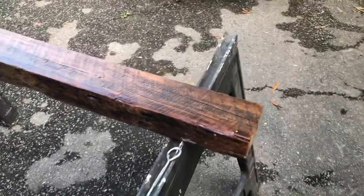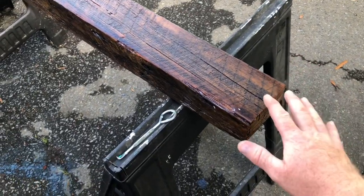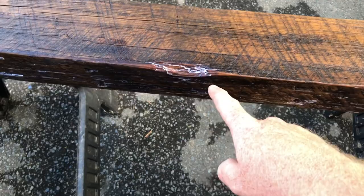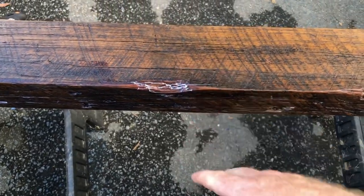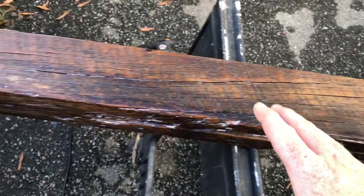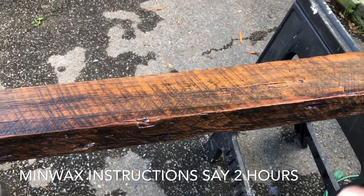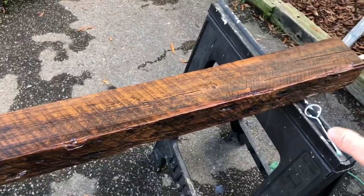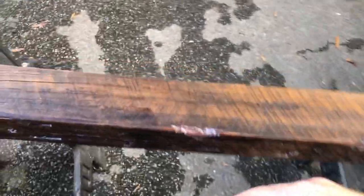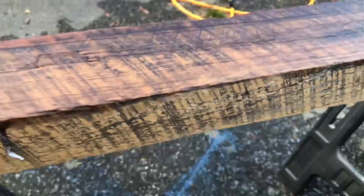You can already see the difference it's making. We've done two out of the four sides — I don't want to turn it on the wet side on the sawhorses while it's still wet. Here is a side with one coat; as you can see it looks so much different. These little air bubbles from the brush will eventually dry out and you won't see them. If you do, you can sand it again and go over it one more time. The Minwax directions recommend after it's dry — at least two to four hours — hitting it again with a 220 grit sandpaper and then doing one more coat.